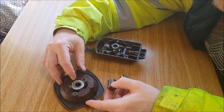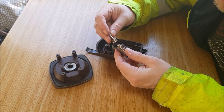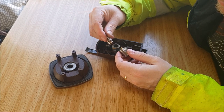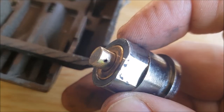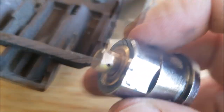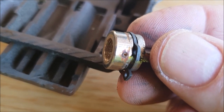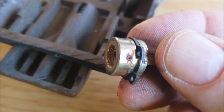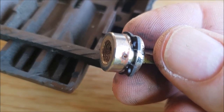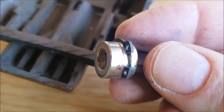Now, the old lock that I took out was in one piece and this lock was originally in one piece. But you can see what's happened — this has separated off, it's just come apart. It looks as if it was just held in with a single roll pin. You can just about see on the lock body where the roll pin is broken going into that central shaft, and on this part you can see the other half of that roll pin. And that's the only thing, it looks like to me, that stops that rotating. And because that snapped, that was why our whole lock was rotating in the outer handle without really having any effect on the lock inside.